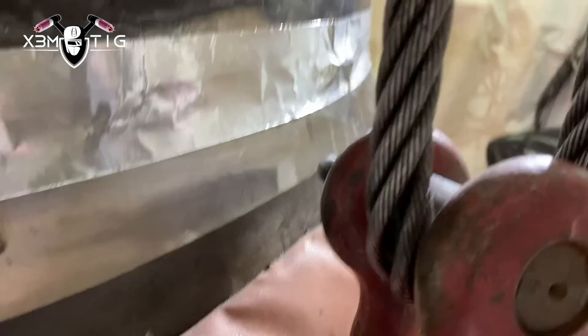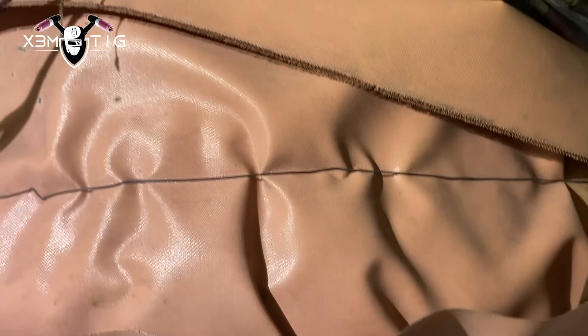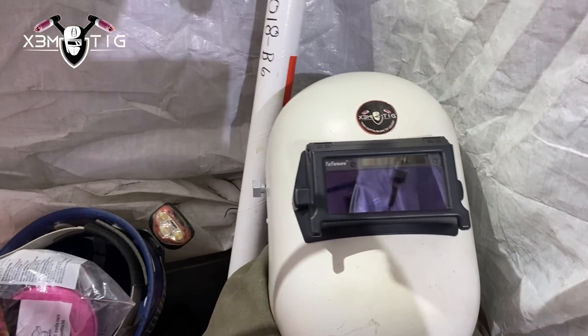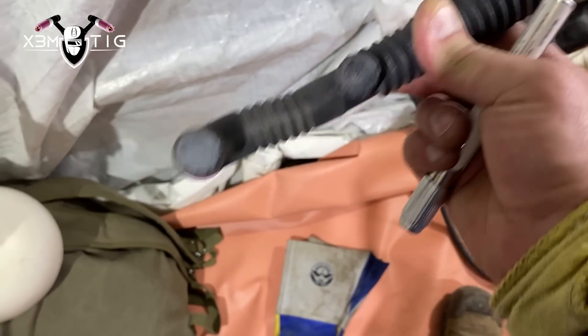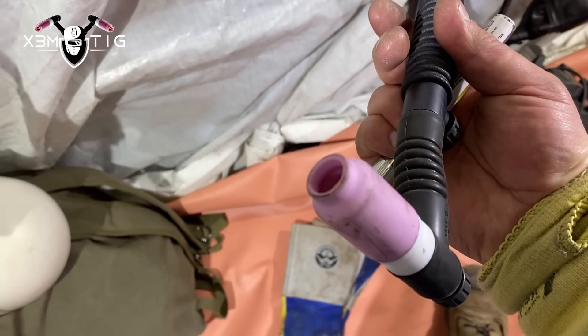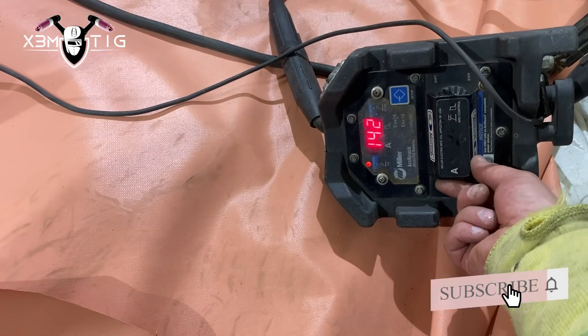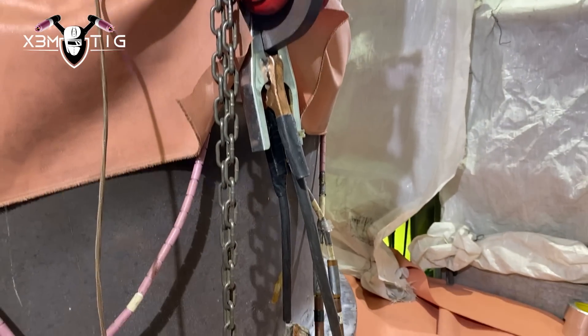As you can see, we have chiclets on both sides preheating — it's 350°F and they have to maintain that temperature prior to welding. The fit-up is good; the day shift did the fit-up. We have to maintain a 650°F max for interpass temperature. If it goes above 650 you have to wait for it to cool down. I'm going to use my new Pipeliner helmet — beautiful with an auto-darkening lens. As usual, 150 Mickey Mouse tools on big jobs like this. And this is our Creature remote.